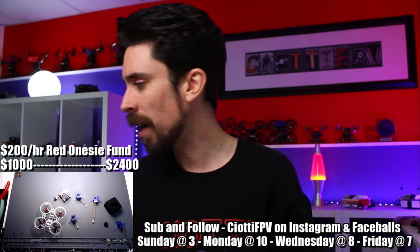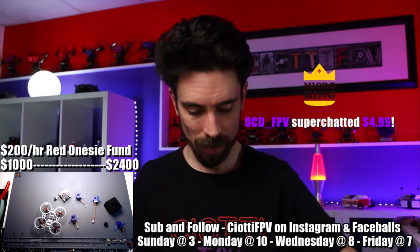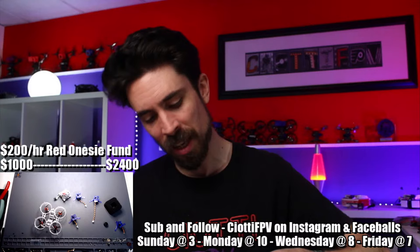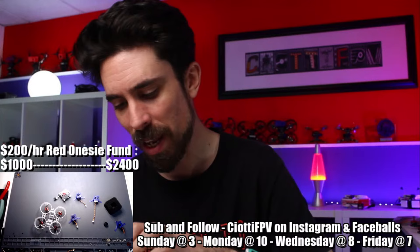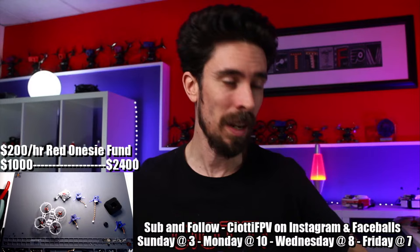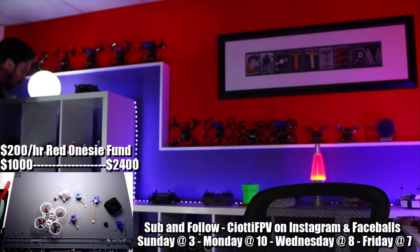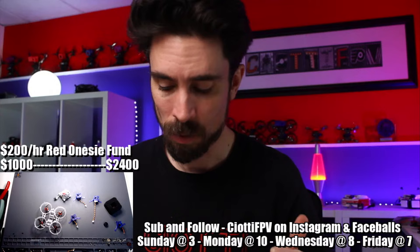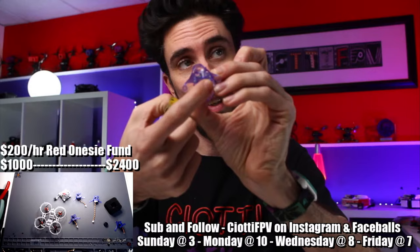So the hummingbird canopy is called the Nubidrone Goober canopy. Goober is the name for it. There are different sizes of the McStinky mount, so the weight could go up or down a little bit. This is kind of the middle size, and it's 0.81 of a gram. The Goober canopy is at least 1.8 grams. The Goober canopy is a little bit heavy. Let me see if I have one. They might all be mounted up to the builds. Nope, I'm going to have one in here. The Nubidrone Goober canopy, this is the purple one with no camera in it, is 1.5 grams with the internal piece that is needed to hold the camera and the two screws in it. So, yeah, there you go.